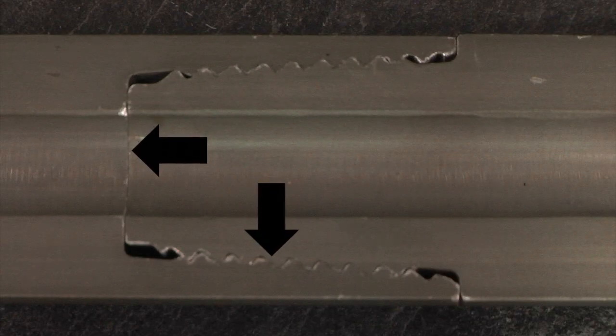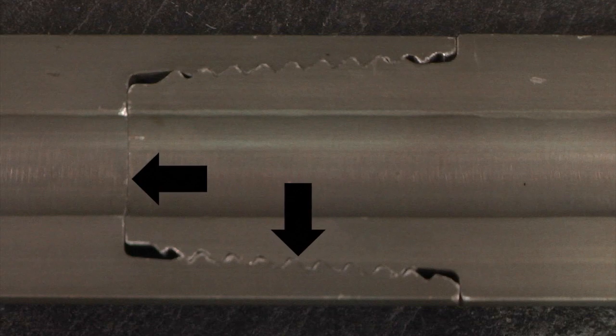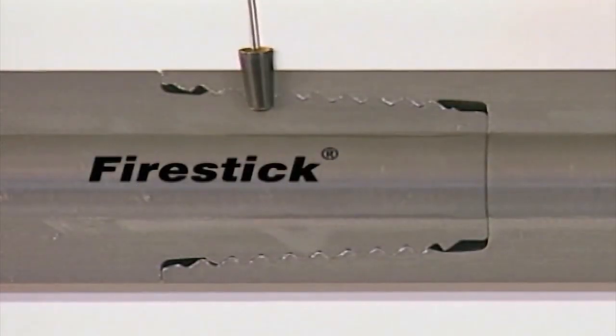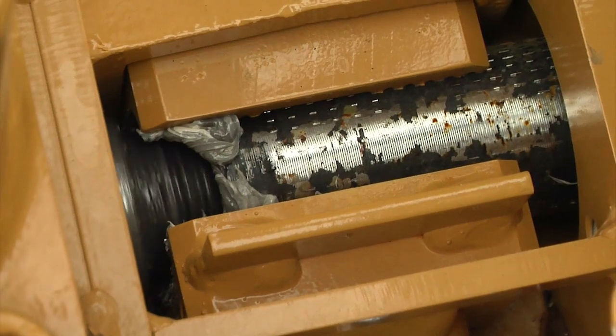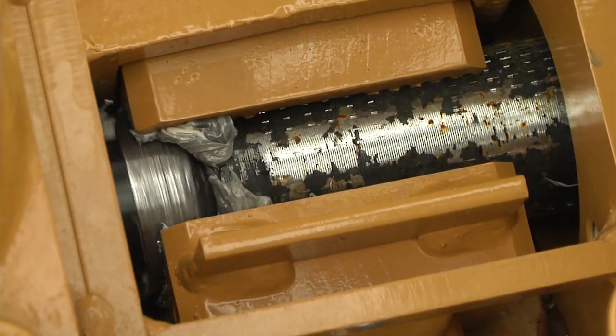There is a barely perceptible thousandth of an inch gap. When optimal makeup is achieved, this gap closes with this double shoulder design. Both the inner and outer shoulder handle the down hole stress, lessening the threat of swelled box ends which result in pin fatigue. It's one of the reasons clean threads and complete use of full makeup torque are critical components of directional drilling success.